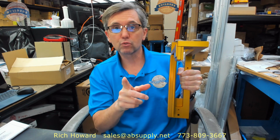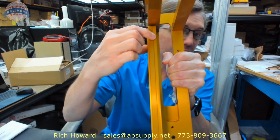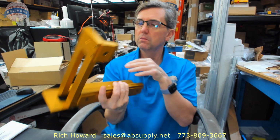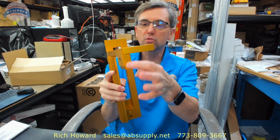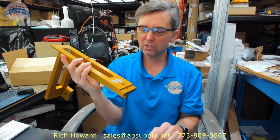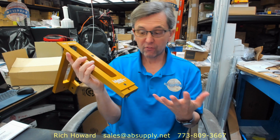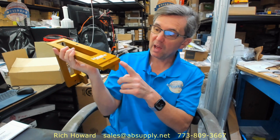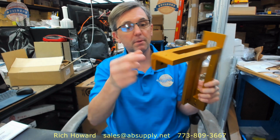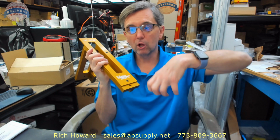We'll look at the instructions and we'll talk about what you do, but just be mindful. You've got the 1/8 inch shim here, you've got the 1/4 inch shim here, and you've got it back here as well. The initial question you might have is, how do I get this attached to the door? Well, you're going to have to clamp it to the door. And if I were to make a recommendation, I might have looked to make this portion longer at the top and bottom and then used a couple of biparting elbow clamps.